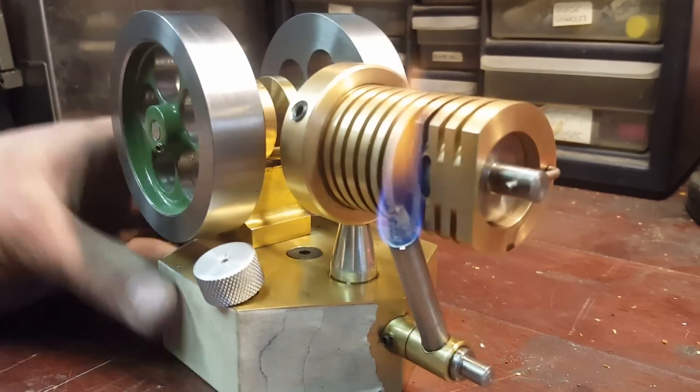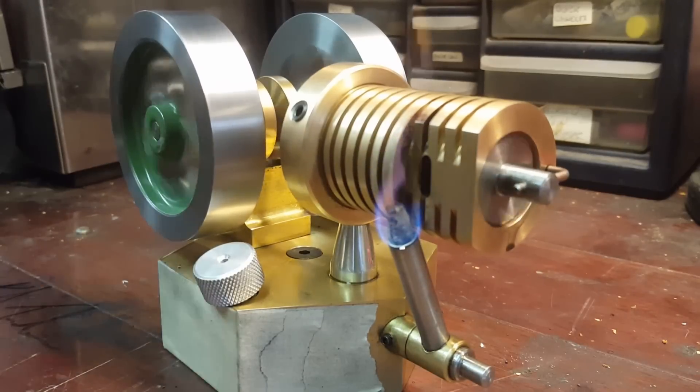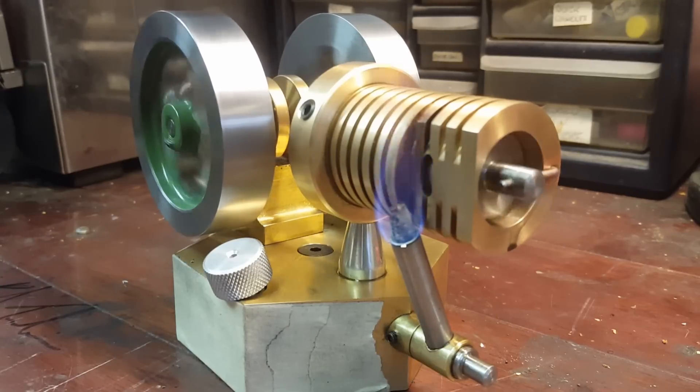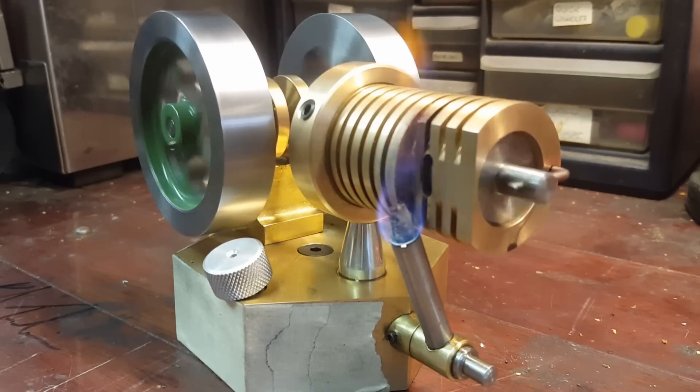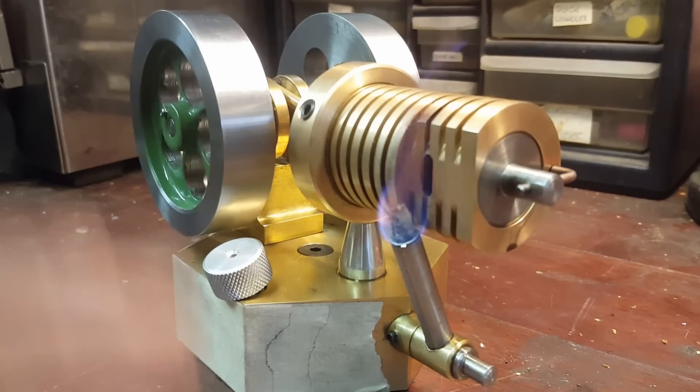There it overheated — that's pretty much it. At this point it will struggle a little bit. I could add a bit of oil to seal up the cylinder, but I don't want to go that route. I'm going to correct this by using graphite pistons and designing it to run hot instead of at room temperature. This way it should run until it runs out of fuel.